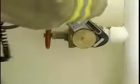A lot of times in these standpipe systems we find that it's frozen, and that's the reason we carry an 18-inch aluminum pipe wrench. It's the only pipe wrench that will fit around a 2.5-inch thread. We use that, we set it, and we spin the cap right off.